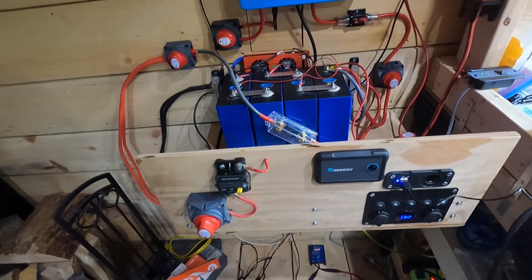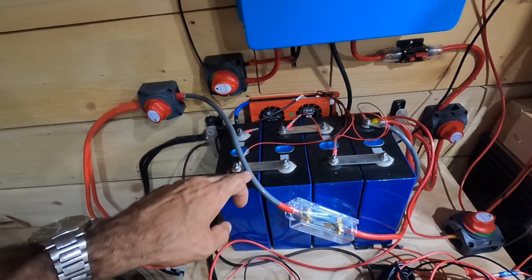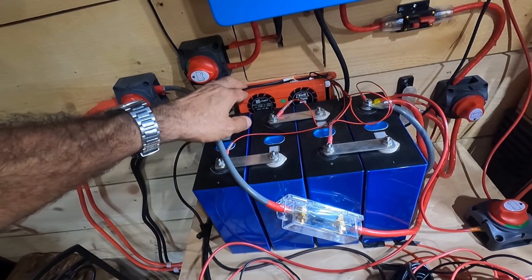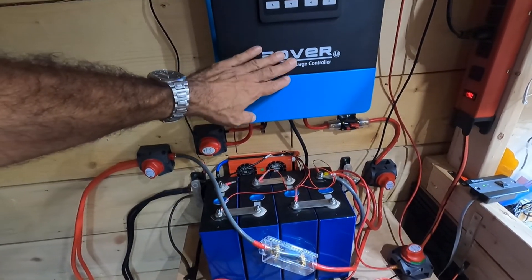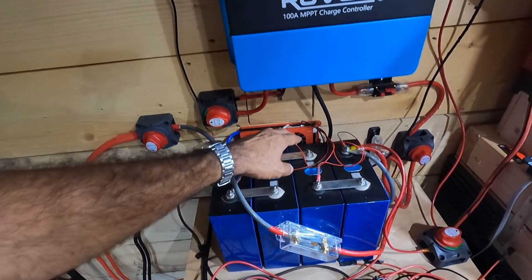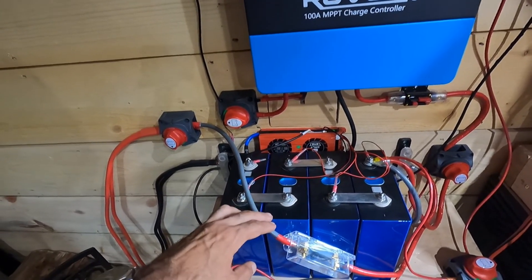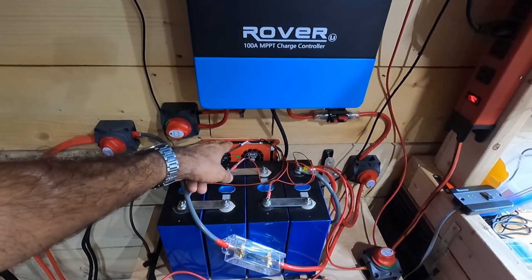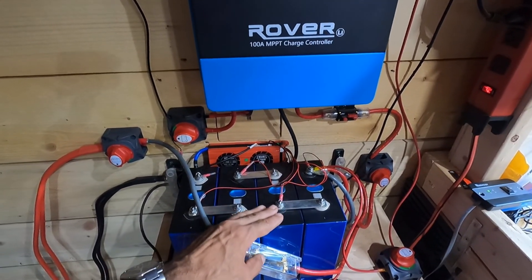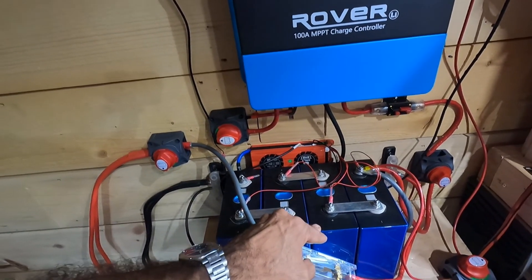The inverter, as we said. And up here I have a shelf on which the cells are located. These are 3.29-volt cells, connected in series using these bus bars, and they are managed by this smart BMS — a battery management system. What it does is ensure that the charge being pushed to these batteries from the charge controller is equalized across all of the cells. It also monitors discharge and is able to boost voltage to cells getting more discharge than others. It increases the longevity of the cells. If you're going to build your own battery pack from multiple cells, it is highly recommended to protect your investment with a BMS.